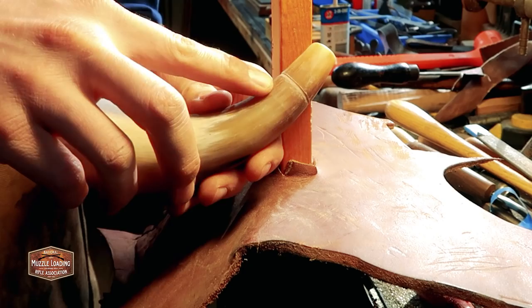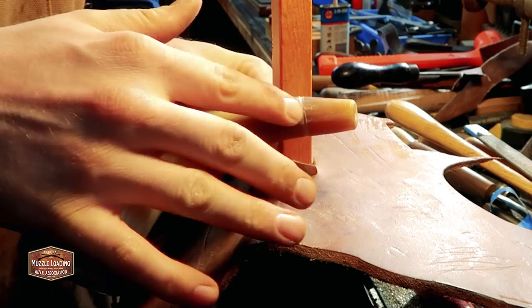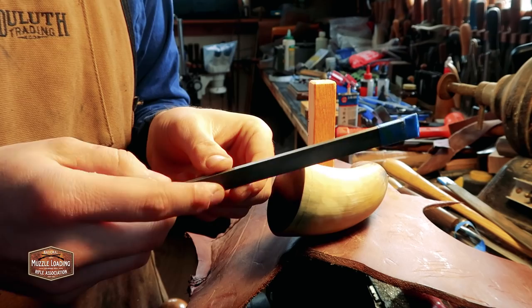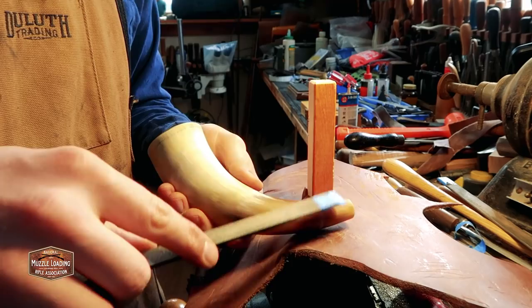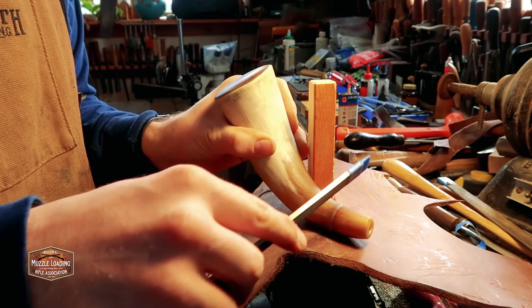I'm setting the bottom corner of the file into that groove at an angle to lock into it. If I hold it flat the file skids, but by turning the file up on an angle I catch into that groove and I'm able to file this neck. I'm making progress there, so I change the angle on my file a little bit to establish that change a little farther back. Now I'm going to get a file with a safe side on it so I can put the safe side up against the spout so I don't mar that edge, and then work on bringing this neck down.